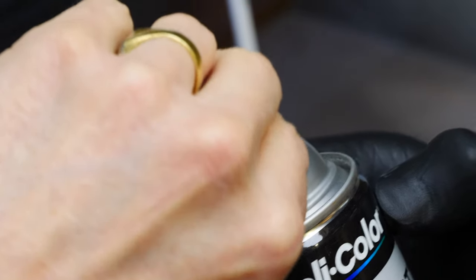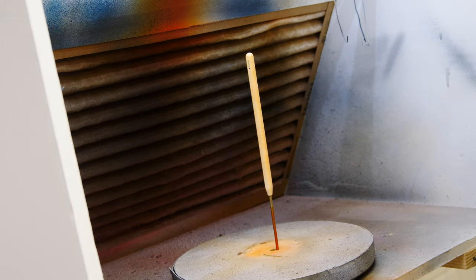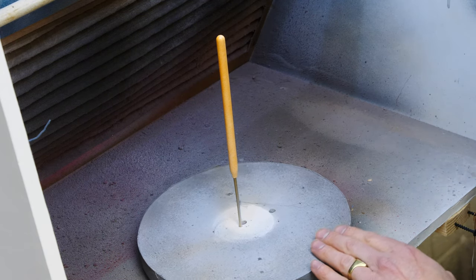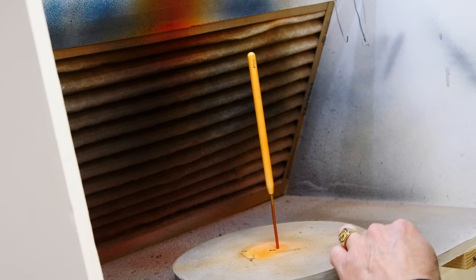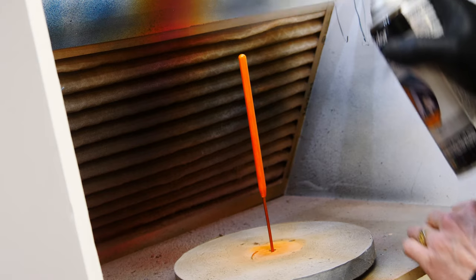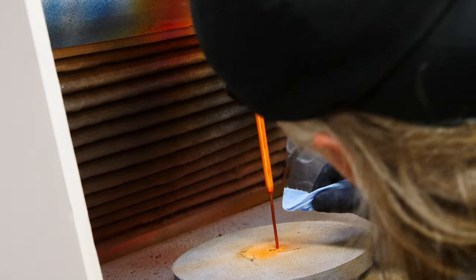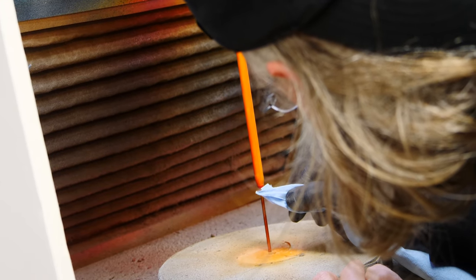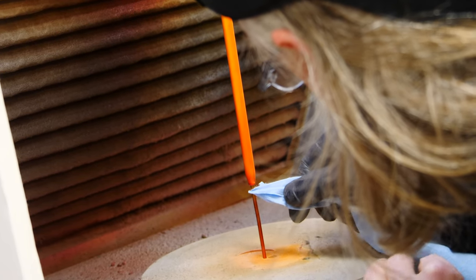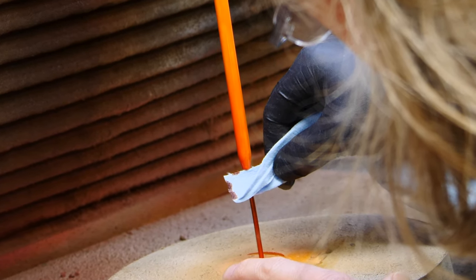Let's try the metal cast again and see if we're more successful. I'll turn the fan on to the foam core spray booth. Rotate the nozzle tip 90 degrees so the fan pattern is horizontal, because we're painting up and down on this object — we don't want too much paint hitting the item. This is critical since it's a very thin item. Lots of light coats. It's basically a clear coat with some tint — very thin, tricky paint. I'm getting a slight run at the bottom, but I can come in with a rag and soak up the extra clear/pigment to get a nice uniform finish.